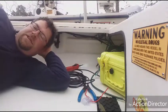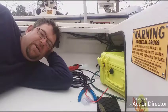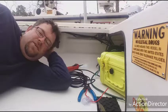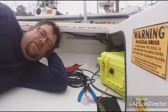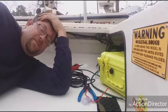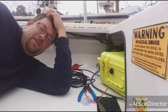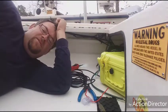These lights you have to have everything go positive to positive, negative to negative. Make sure you use whatever fusing they say to put in there, and the right amount of wire for your length. Remember with DC: if you have a light that is 10 feet away, you have to calculate the number as the travel there and the travel back. So double your length when reading the gauge chart.